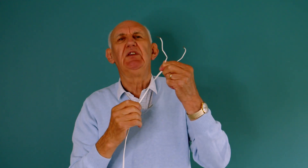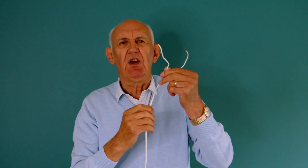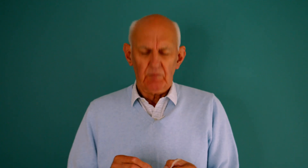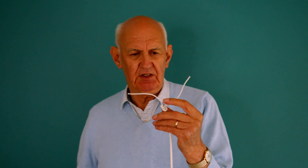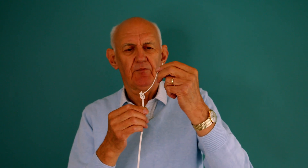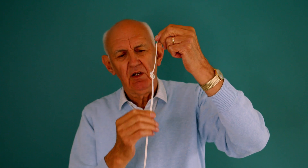There we have a very simple dipole with twin feeder that works on a single band, or two bands - a 40 meter version works on 40 and 15 meters. A better way now than using just twin flex is to use 450 ohm ladder line. Taking this further, K4ESE came along and saw this dipole, had an idea, got a pair of wire cutters, and cut off one side of the dipole. He was left with a quarter wave, which became a vertical, still fed with balanced line.